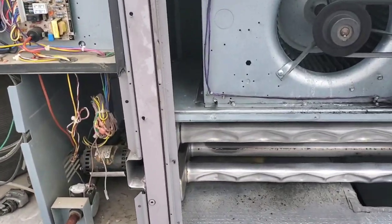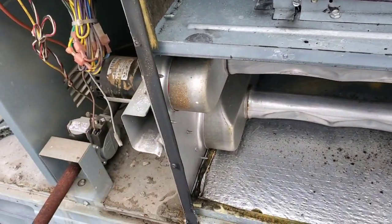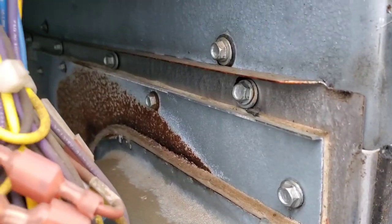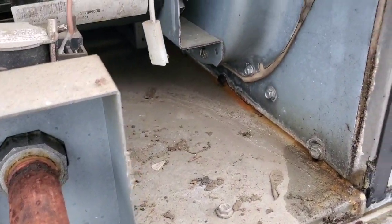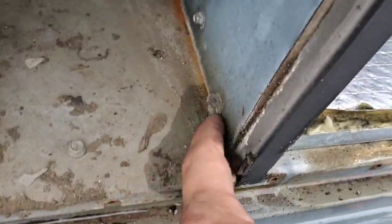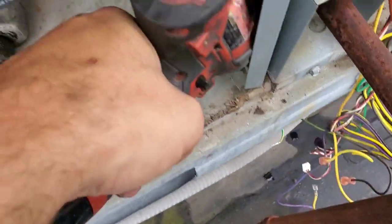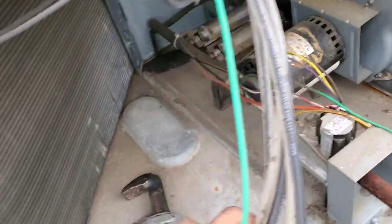To get the heat exchanger out, we go through the side. I'm going to take this little beam out of the way. That's the heat exchanger and that's the unit. We got a row of screws between those two lips on the top and bottom that we have to take out. The bottom part is kind of inconvenient, but the bottom ones have to come out. So we take loose all the wires that go to the heat stuff, and we take out this one lone screw right here, and then the whole panel comes out.